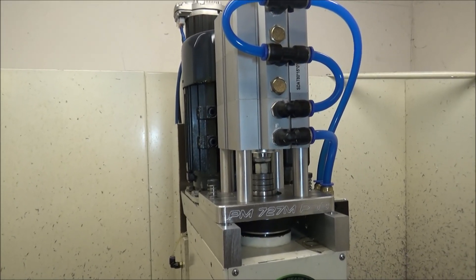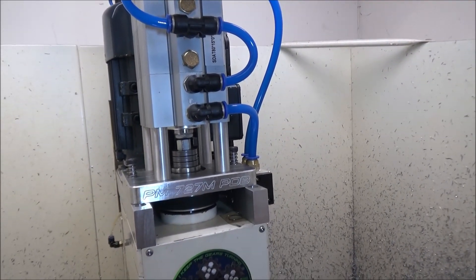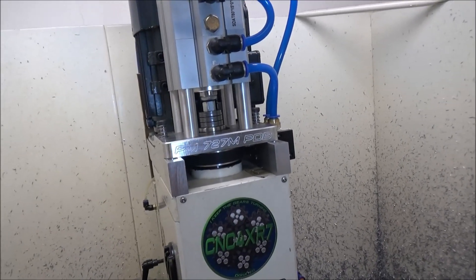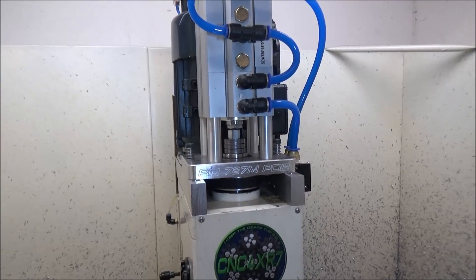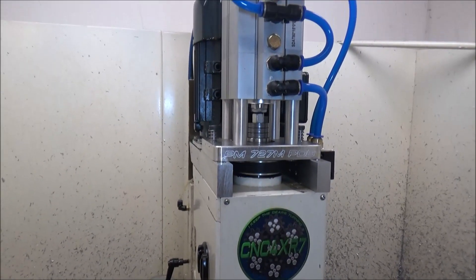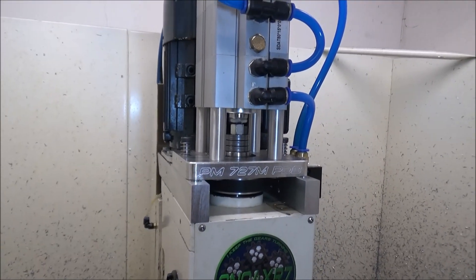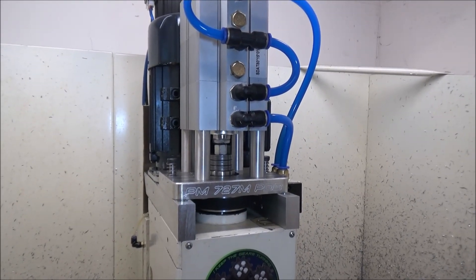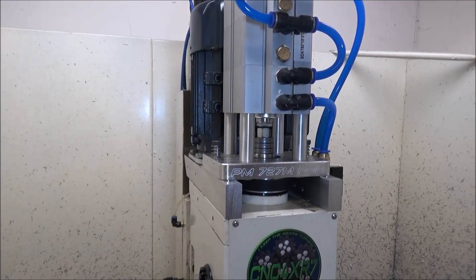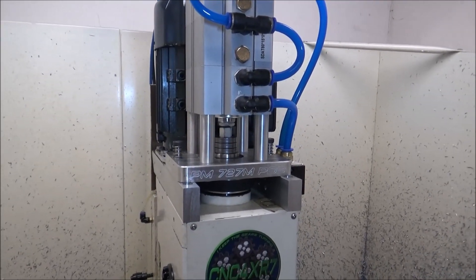Originally there's just no torque with this motor, so I wanted to upgrade it. However, this required switching over to 220 volt power and redoing my entire control cabinet, and I just didn't want to get into that. After I upgraded to the clear path servos on this machine, I didn't have to switch over to 220 volts — I'm still running 110 volt power to feed the VFD and the clear path, so everything's still 110 volts.